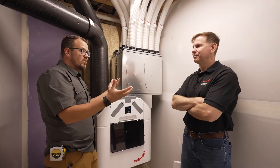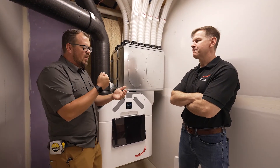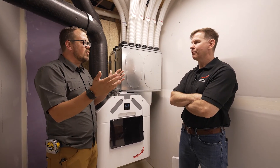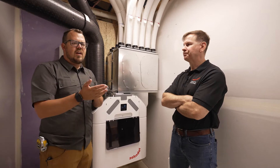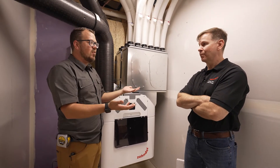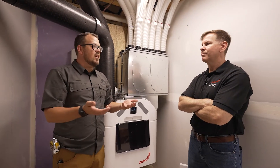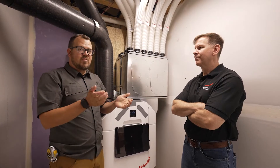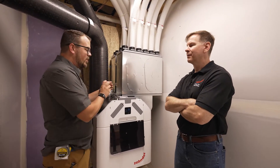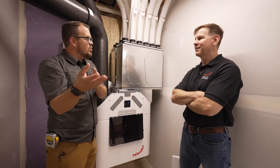It works in winter and in summer. We're somewhere between 4,500 and 6,200 heating degree days here, and our climate has both hot and humid — today it's going to be 93 and really humid — and sometimes negative 15 and very frigid. So while this is an ERV and not an HRV, we are going to add a little heat booster for those really cold days.